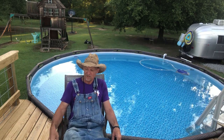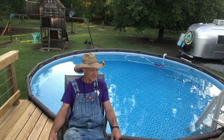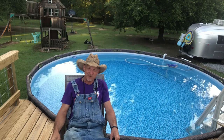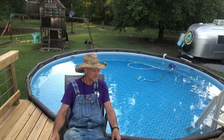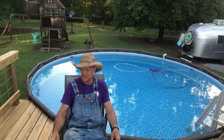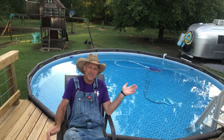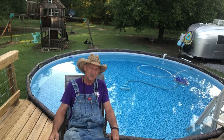I had a comment the other day saying that deck is an awful lot for a pool that ain't going to last two or three years. Whoever gave me that comment must not have watched my video when I built the deck — the reason I built it the way I did, I said in the video, was so that when the liner needs replacing or we want a new pool, I can easily do it. And if we decide we don't want a pool anymore, the way I got my legs — not concreted in the ground but concreted below the ground — I can take two tractors and pick this deck up and move it around to the front of my house if I want to.